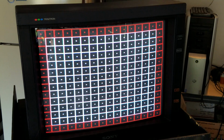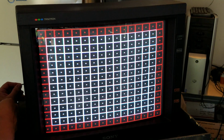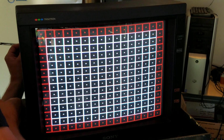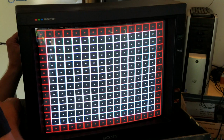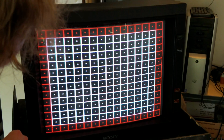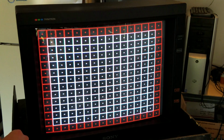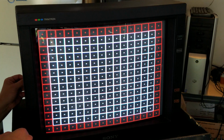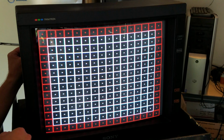So the first thing I'm concerned with is trying to get this thing centered a little bit. And to do that properly, I like to always make my sizes a little bit less than I would actually keep them after I'm done sizing the whole screen. So I'm going to start, and I'm going to shrink up my horizontal size so I can actually see the entire grid. And then I'm going to go towards the middle horizontal center.